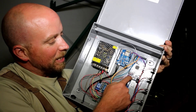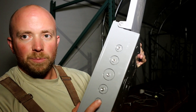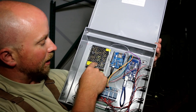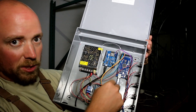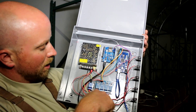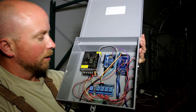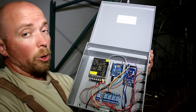We need this board to just talk to these relays, these switches, to turn on power to all these power ports so that we can actually turn valves on and off. We have a 12 volt power supply so we have AC coming in connecting to that. Then we have 12 volt going to the mega which also powers this - they're slaved together. We have our five volt bus with our ground bus and those all connect to the relays, and then 12 volt also provides power to each of these power ports which we'll connect our control valves to for the aquaponics.